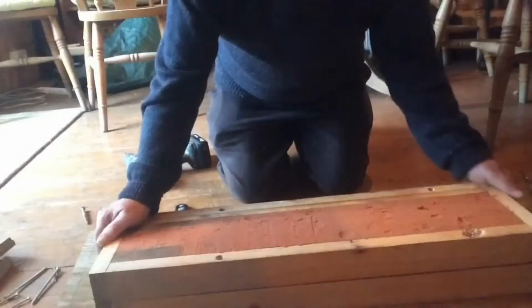From what I gathered, a Celtic sword is between 700 and 800 grams. Now in total, I put in 1,000 grams: 900 copper and 100 tin, 10% tin. So obviously my pattern's been too big, so I don't know what to do there. Leave it as is. Wait and see what this turns out like. One step at a time, I suppose. We'll see what happens. Let's see what kind of mess this is.